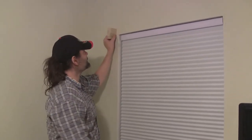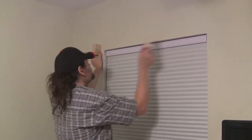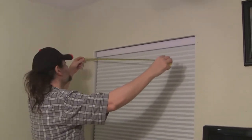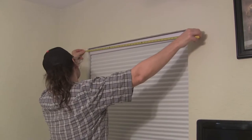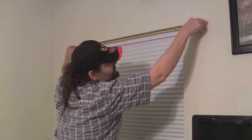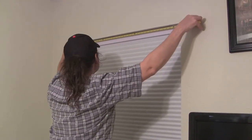These are my two side pieces which are going to go just like that. Now I'm going to make the piece that goes across the front. I'll measure the front for the front piece of the cornice — I want it to go 2 inches past the window on each side, so that's going to be 40 inches for the front piece.